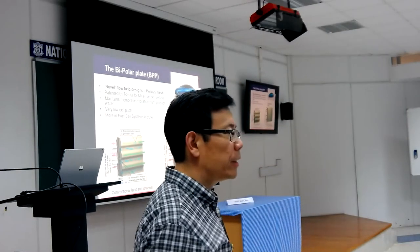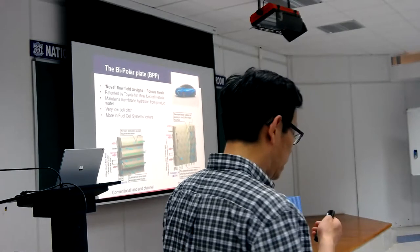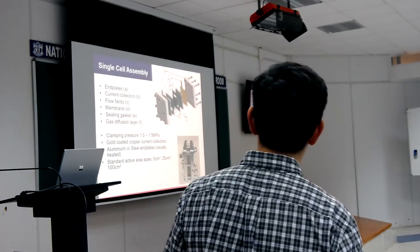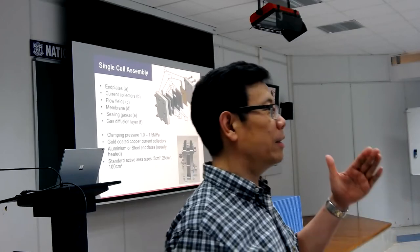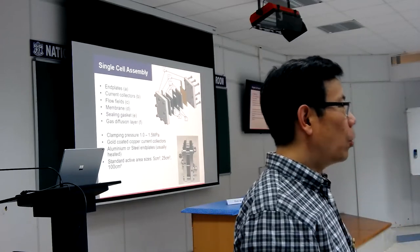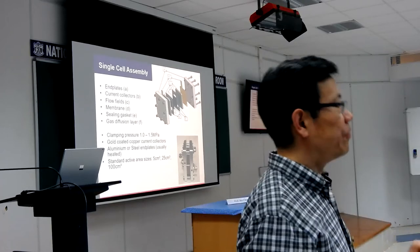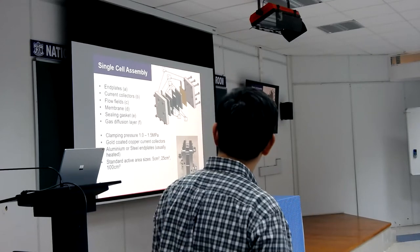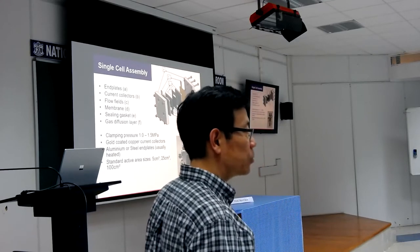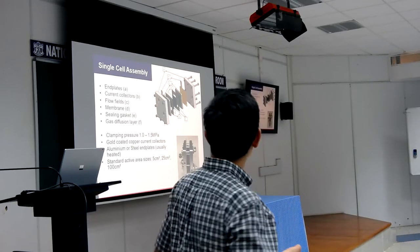In conclusion, channel design has many, many different ideas from different manufacturers, depending on their experience and analysis. We're moving fairly quickly through bipolar plates because the bipolar plate is a supporting unit — although it is equally important, it is really supporting the MEA's reaction. The MEA is the fundamental component. The bipolar plate provides the channel, structural strength, gas diffusion support, water removal, and thermal control.